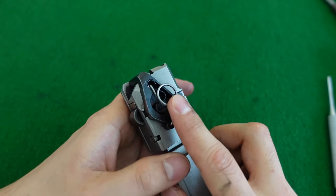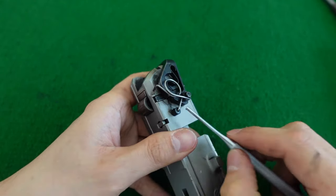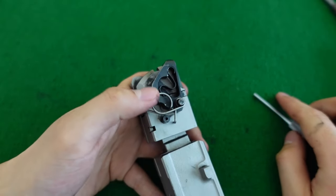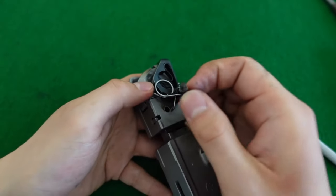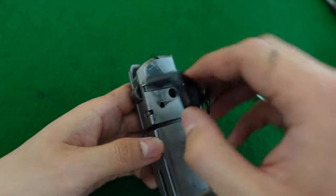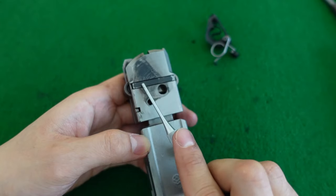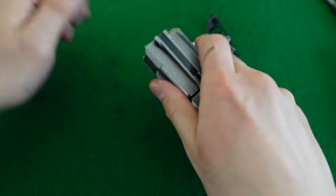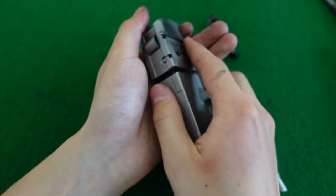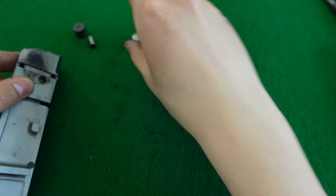To initiate this, I'm going to unhook the ejector spring and lift the rear leg of the spring to clear the stop peg. Now that the stop peg is free I can extract it out, which allows the ejector to move beyond its normal position and be simply removed. Now that the ejector is removed, the roller retaining bar is exposed — I can tap that out, and out come the roller and roller bearing assembly on the left side and on the right side.